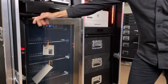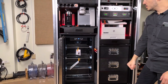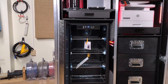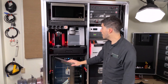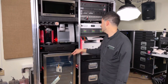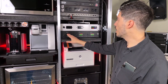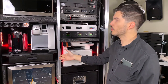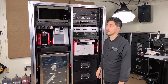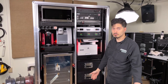The fridge is a nice stainless steel with a glass door so you can see exactly what's in it. It has an internal light so you can see what's going on backstage — a nice blue light so it's not going to kill your stage lighting or your night vision when you're on stage. Something to point out: it's at 34 degrees right now in max cooling — we just powered the case on and it is drawing less than one amp; it's not even on the meter. Although we did overkill as far as metering goes, we've run all of this on at once with both coffee machines and the microwave running and you can easily run it off a normal standard residential Edison line. Can you use all of this at once? Yes. Should you? No. But you can.